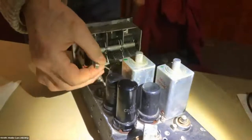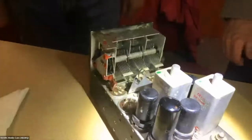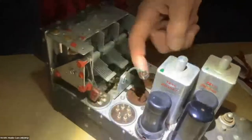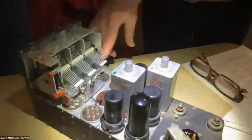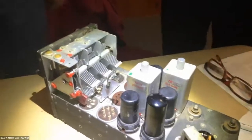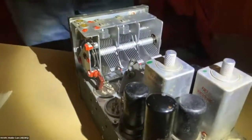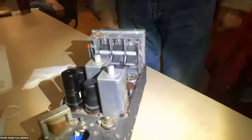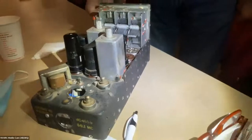I have a matching transmitter for it. It has a plate cap on top, which is the mixer terminal. I pulled the two tubes and removed the cover — which required removing about 35 three-by-48 screws. The max voltage here is 250, and they'll run as low as about 110. I tend to run them on whatever power transformer I find in junk boxes — somewhere around 150 to 170 volts works fine.